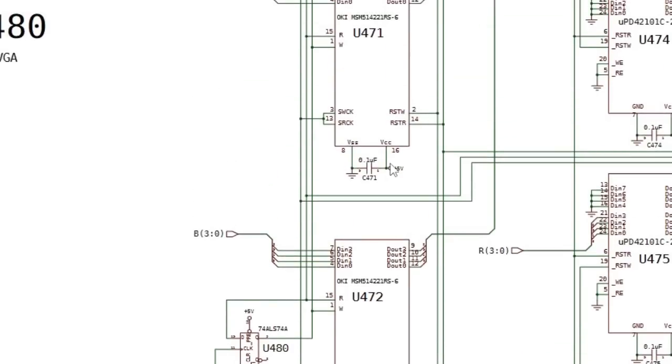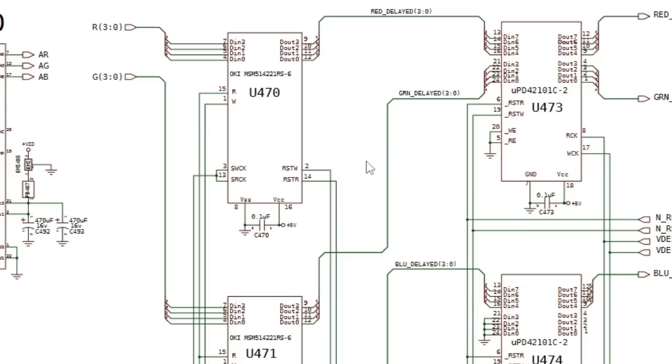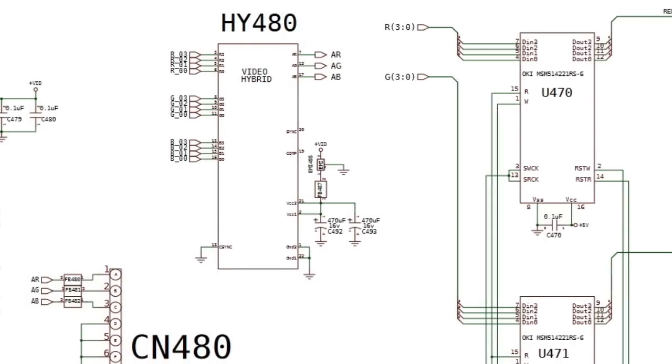as the pixel data is fed from Amber. And at some point I may try to produce in CPLD my own replacement of Amber, actually. I wouldn't mind having a go at that. I've talked about that a little bit in Discord. I can't imagine it being that difficult to achieve. The hardest bit is producing a proto board with a CPLD on it and wiring everything up so that all of the connections are in the right places, effectively. Actually, trying to get it to go into a PLCC socket is the biggest challenge, I would say.